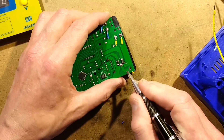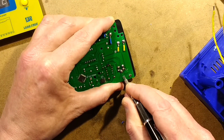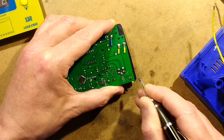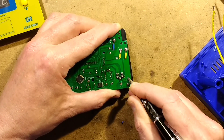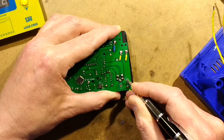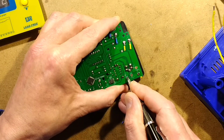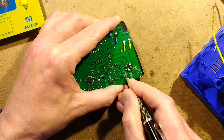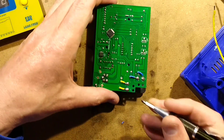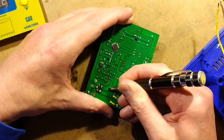What I'm going to do is make new pads a modest distance from the original one. I'm just going to scrub through the solder resist until I've got a clean bit of copper. This is quite tough, and this screwdriver has seen a lot of abuse. It's strange that this has happened in the first place - it should have been obvious that this was a problem, but they've not really addressed it.